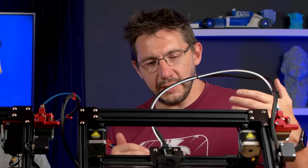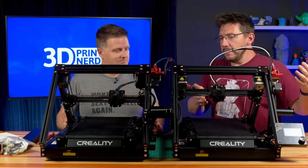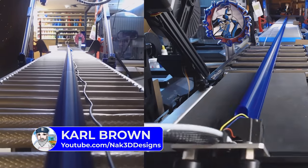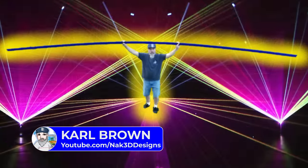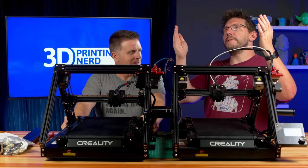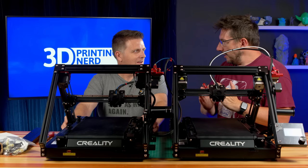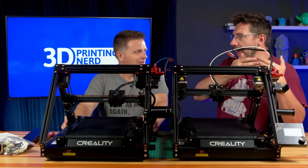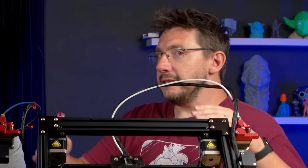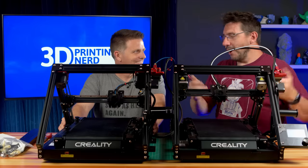Because the machine has to eject parts or make parts that are multiple feet long, you either have to account for horizontal space to hold and support the longer objects, or a bin to catch objects. By mounting it on a wall, you're effectively making your print travel with gravity, which means you no longer have to add that support on a horizontal plane. And it's on a wall, which is already going to take up space that isn't being used anyway. Oh, that's awesome.